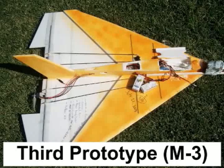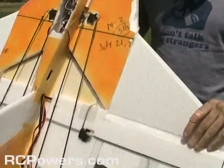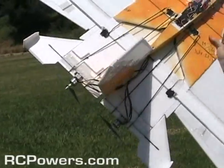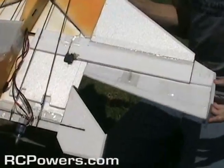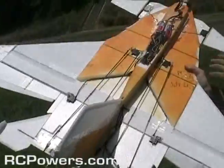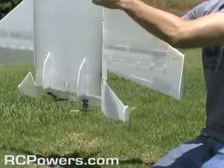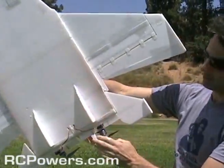This is that same platform that I've cut down and changed probably six or seven times experimenting with the wing configurations. Last week I had the wings straight and back, and then doing a lot of studying this week, I think what I'm going to need is something along these platforms. I need more aileron on the wingtip so the wingtip does not stall first — it stalls last. I need elevators and canards and then more vertical stabilizer surfaces. I've got some vertical stabilizers underneath as well, and they also act as motor protectors.